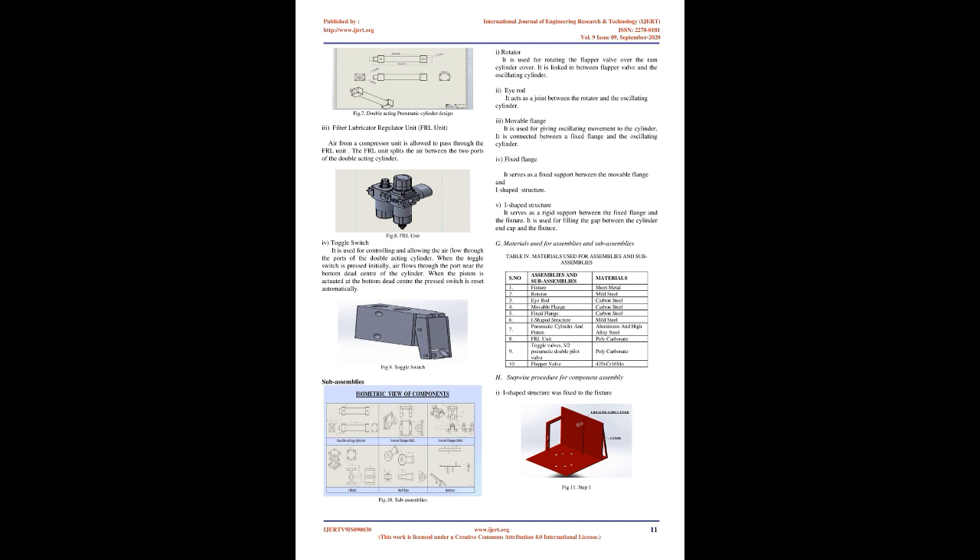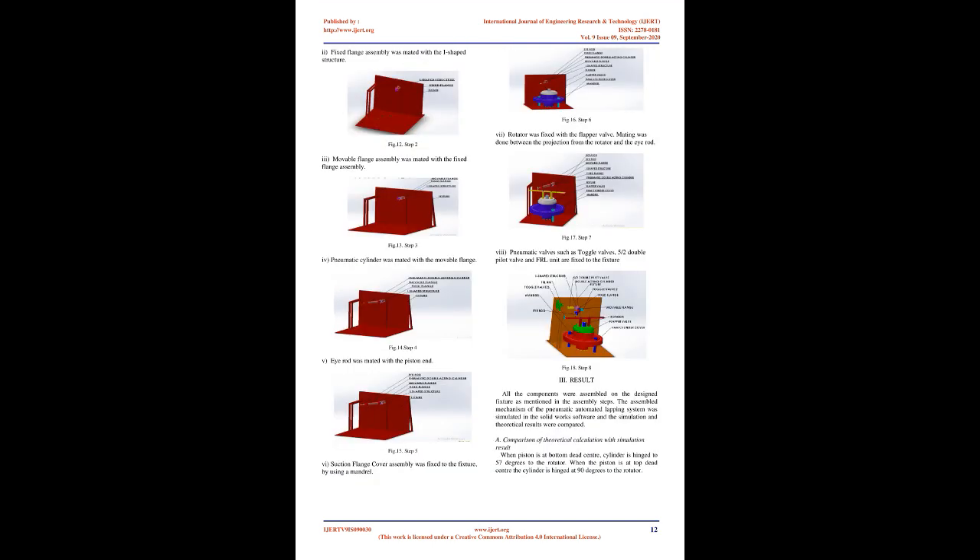Table 3 — Technical Analysis on Pneumatic Switches: (1) Standard Solenoid Valve — merits: versatile and adaptable, fast response time; demerits: availability of electrical source is mandatory, the valve can partly close if the magnetic field isn't set up correctly, and it is costlier. (2) Mechanically Operated Direction Control Valves — Button Switches — merits: cost efficient, does not require electrical source; demerits: cannot automate the mechanism, does not have fast response time.